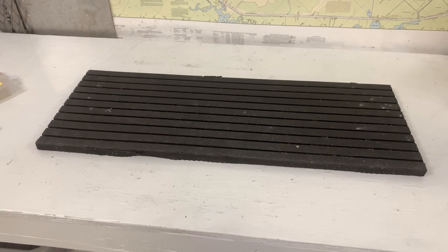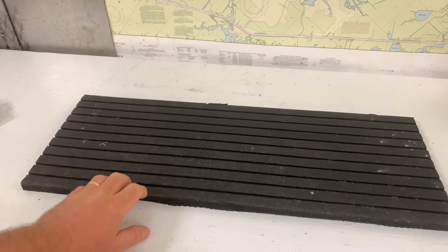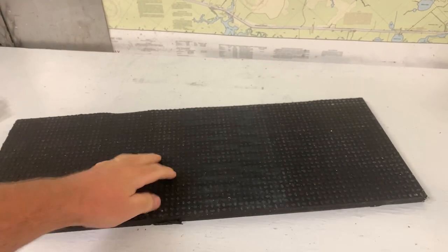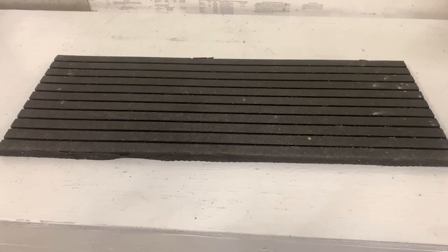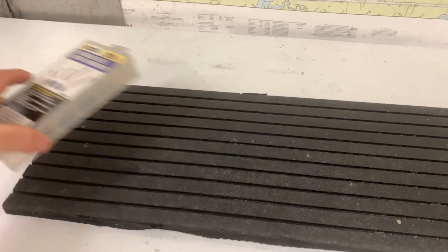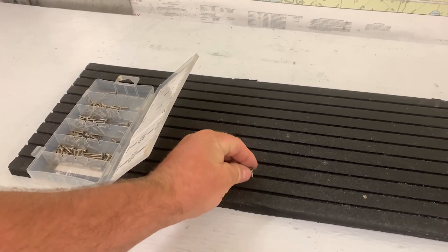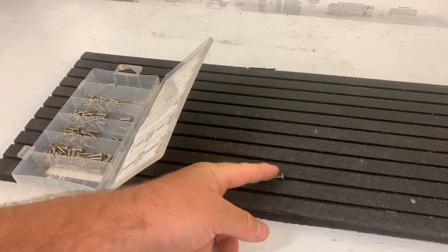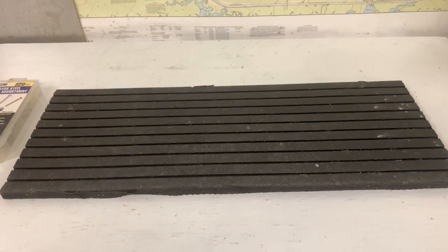We use horse stall mat. This type of mat is available at just about any equine supply or feed store. We found this at a local fencing company in Galveston County. This stuff has got grooves on one side, which is somewhat unusual, and for your project it may be worth seeking out this exact type. The back side is flat with a diamond plate pattern — that's the side that's down on the wood. We like the grooves because they give moisture a place to go as it comes up out of the water and runs off. It also allows for when you're fastening it down — we used Harbor Freight stainless steel screws, about a half inch long. When you screw them into the groove, the head goes down between the grooves and prevents the screw from ever coming in contact with the boat. Another reason for the grooves is that water runs out and keeps moisture from staying in contact with the boat, which we all know can cause gel coat to blister.